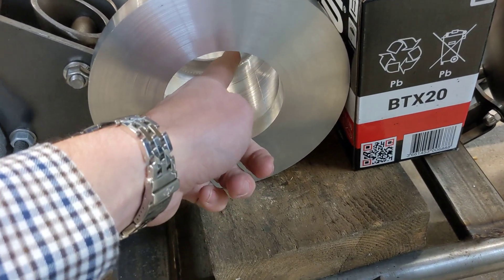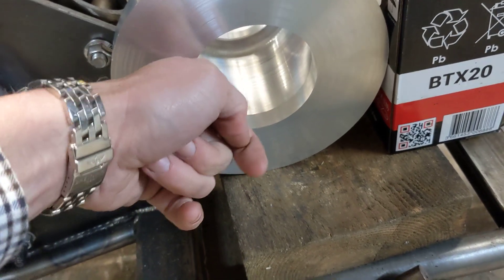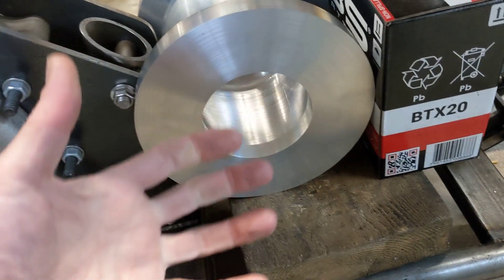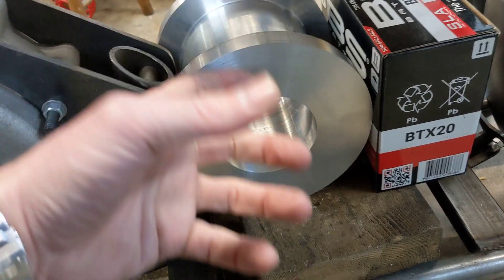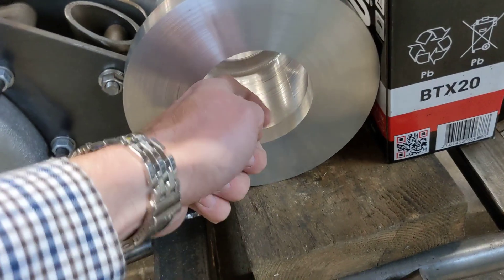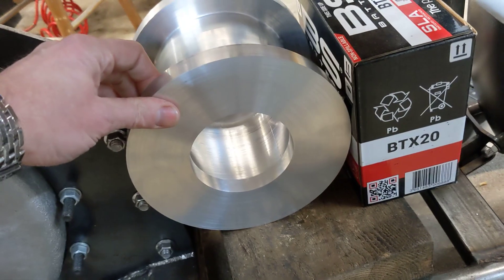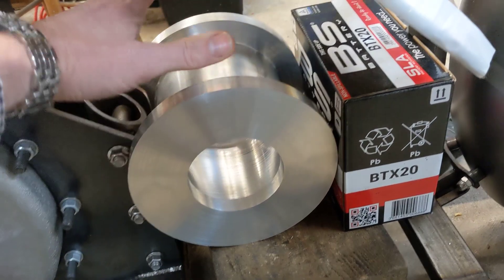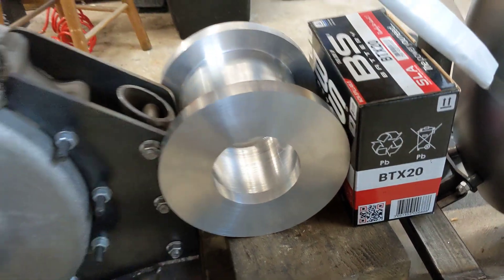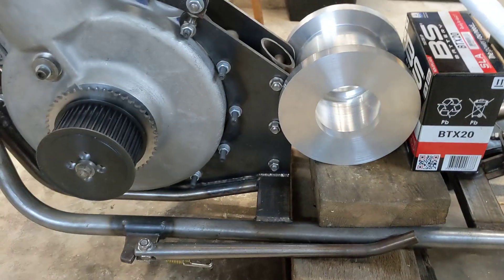It's been quite a difficult operation, Bob tells me. You can see one end when you're putting it in the lathe, but you can't see the other end because it's a blind radius on that side. So it had to come out of the four-jaw, get turned round and clocked in to machine down that end, come out again, turned round, clocked in to machine down the other end. A bit tricky to explain without the thing in front of the four-jaw, but it was a bit of a mission. So it's slightly over diameter, but you get an idea of the size of the gearbox — it definitely isn't going to look like a Norton box or an AMC box or an old Jawa box or a Harley box.